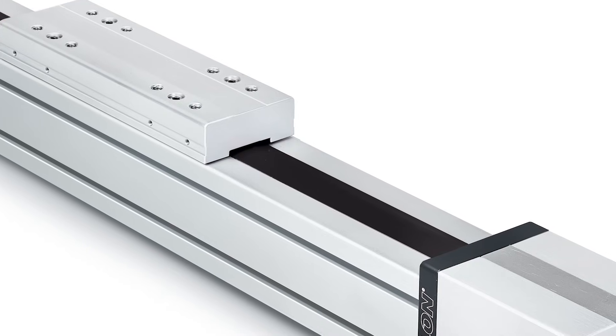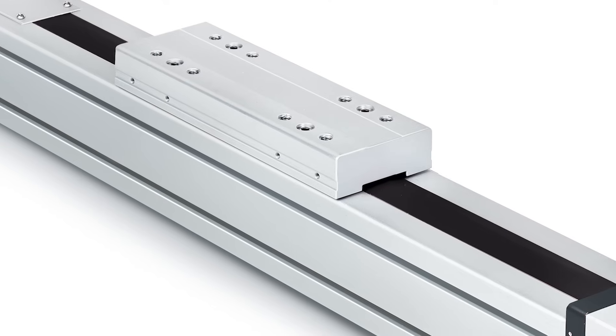The strip on top of the actuator is the sealing strip. It runs the length of the actuator body and prevents most of the particles from escaping the actuator. To maximize containment, the carriage is specialized for the One Series. It uses a line of micro bearings on each end of the carriage to maintain the tightest seal possible during motion.